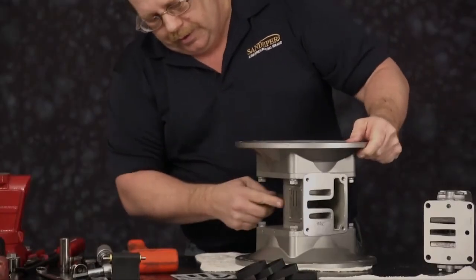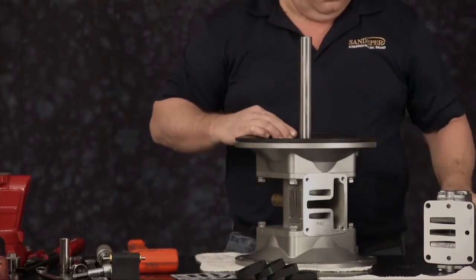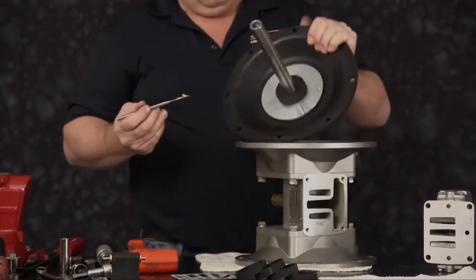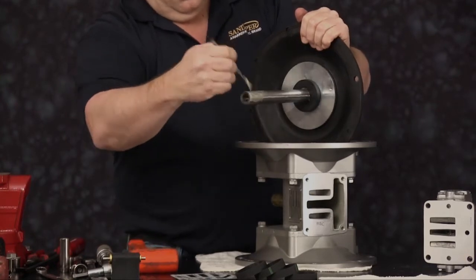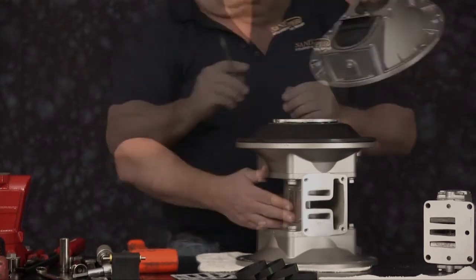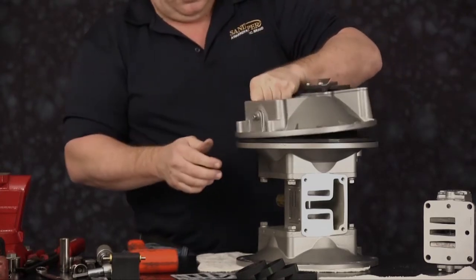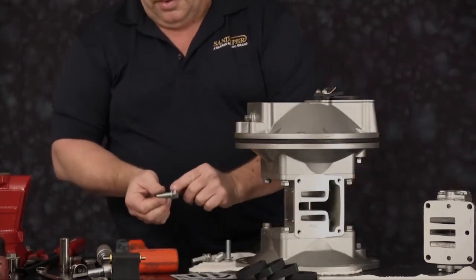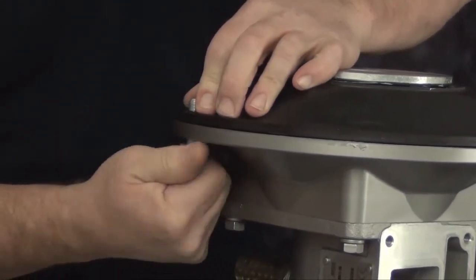We are ready to install the plunger pin and bushing assembly. Flip the intermediate over and install the opposite U-cup seal. Lubricate the seal and inner bearing as well, then install the other plunger pin and bushing assembly. We are ready to assemble our diaphragm assemblies. The serial number plate always faces in the upright direction. Lubricate the main shaft with a light coating of grease. We have already installed our diaphragm bumper. Slide the assembly into the intermediate housing. We are now ready to install one of the outer chambers — make sure the top of the chamber is aligned with the serial number plate. Line the holes in the diaphragm with the inner chamber.